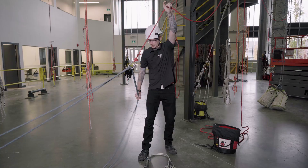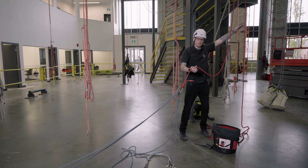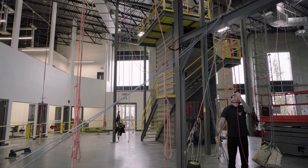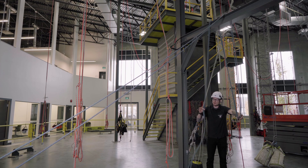I'm rigging a full two-rope system here in one shot ideally. This is gonna be a little bit tricky if you've got a really high distance, but if we're just trying to get to a low beam - kind of oil and gas kind of stuff - we can get up there and have a rig-for-rescue setup. I'm gonna pull the entire loop over the top first, then pull this down into a little zed sort of looking thing, so I've got the loop that I just pulled over and the working lines here.